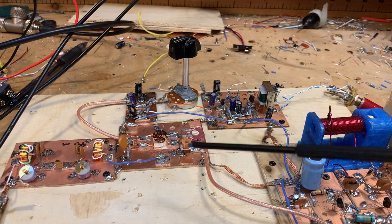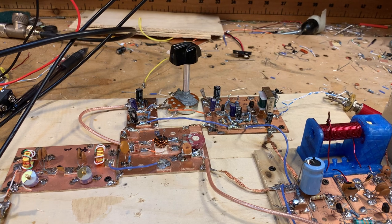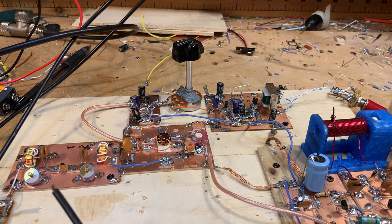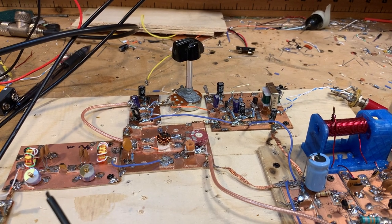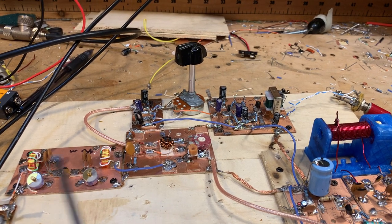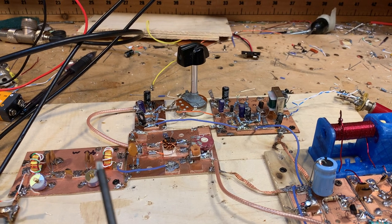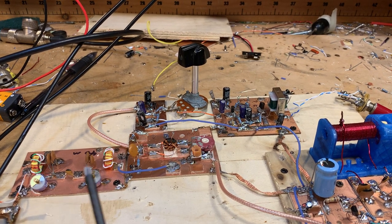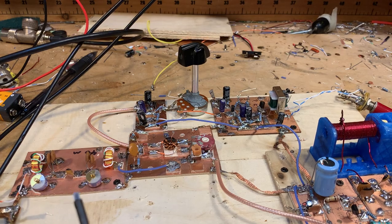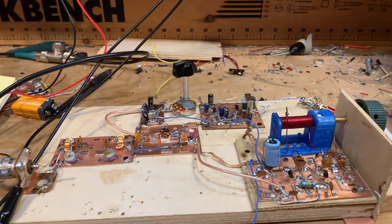We've tried various different mixer circuits and I kind of like the diode ring, but this one works too. For the input bandpass filter, we're using just a dual-tuned circuit — one tuned circuit here, one tuned circuit there — with a couple of trimmers that allow me to peak and tweak it. It works really well, and actually we took the design off of Hans Summers' QRP Labs website.